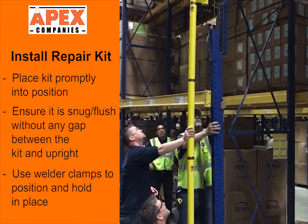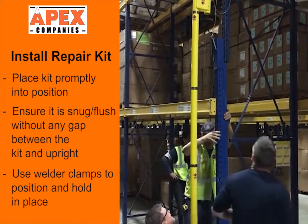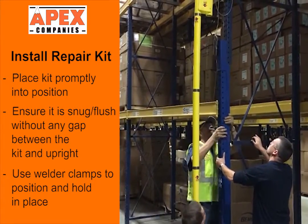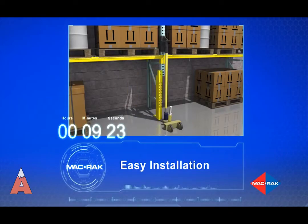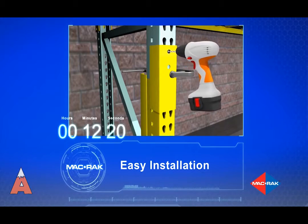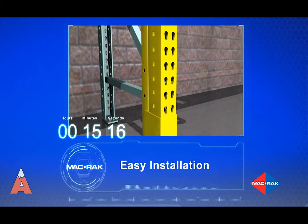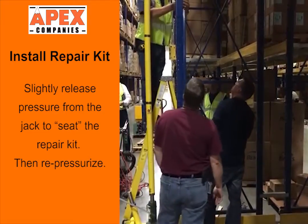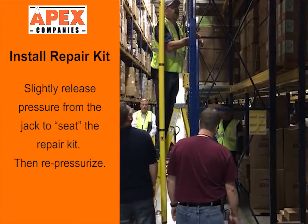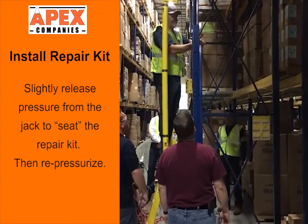Place the kit promptly into position. Ensure it is snug and flush without any gap between the kit and the upright. Use welder clamps to position and hold in place. Release a slight amount of pressure from the jack to seat the repair kit to the frame. Then, repressurize the jack to take the pressure off the repair kit. This is a critical step.